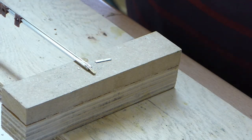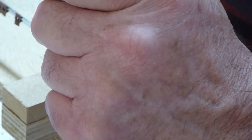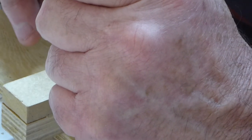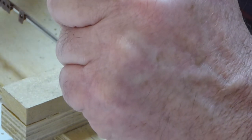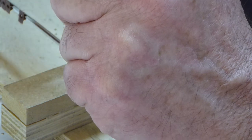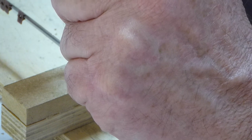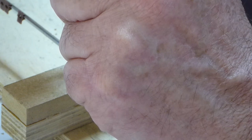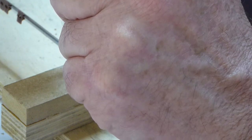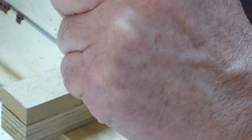Right, okay, so I've got a fine little needle file here that I'm going to use to hold the fish plate on and position it so I get as little heat loss as possible. Little bit skew whiff. Right, okay, that'll do us there, and then put the iron on. We see the solder melt and begin to shine, and we hear the flux boiling away there. Give it a good heat. Well, we've got flux and we've got heat, the solder will flow. Okay, and we're done there.